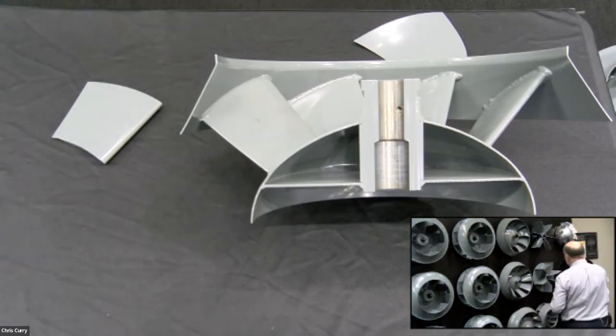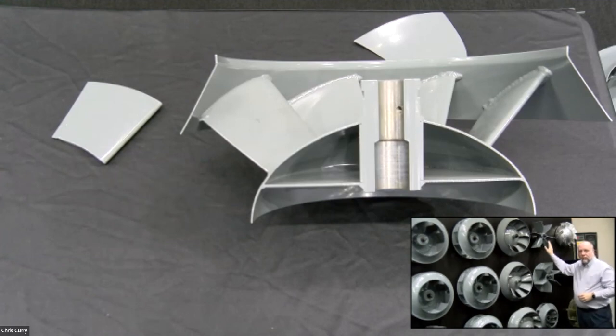All right. So these wheels are designed to convey material. They're going to move air and material, so they have this radial design. This particular wheel is actually used for dust collection. Take the same wheel and put a back plate on it. What it does is it protects the back plate and, more importantly, the shaft back here from long fibrous materials getting wrapped around it. So these are radial wheels in order to move material.